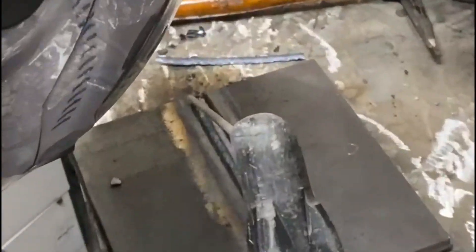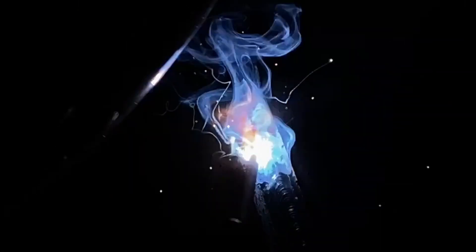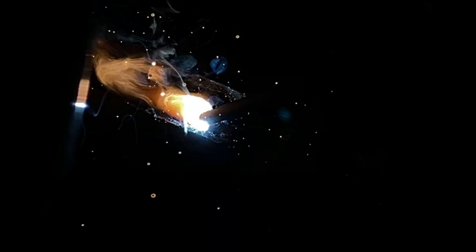With that run complete, descaled and dressed, we move on to our second pass of that layer. As we've left ourselves enough room, we can still get that run into the bottom of the prep. If we put that run too tight then that creates an issue. Then we're just filling it up, doing exactly the same — next layer, still up against the side, slightly kicking towards the side.